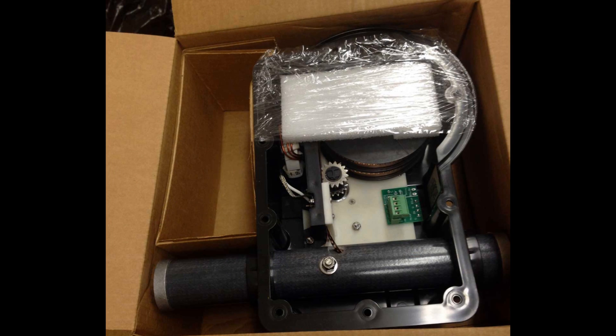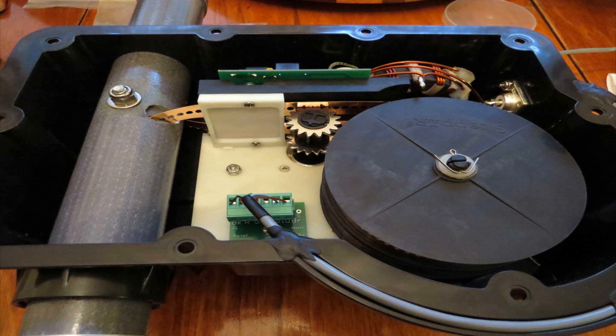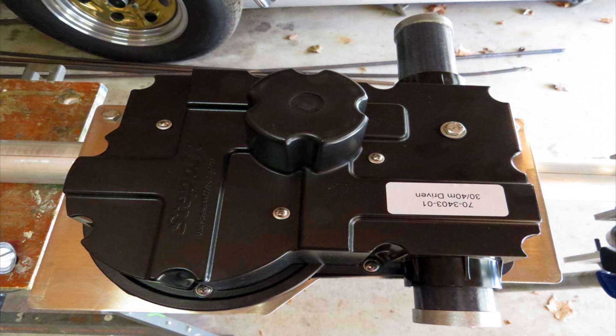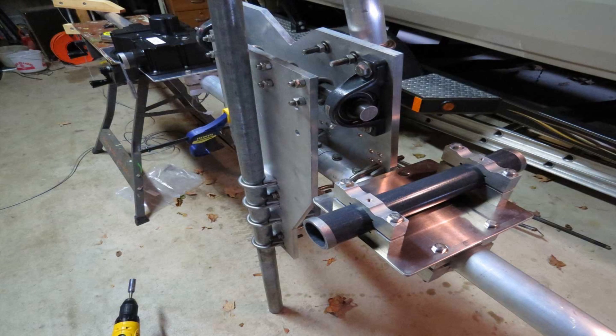The next task is to prepare the element housing units, or EHUs, and the mounting hardware for the elements. Control cables for the EHUs are prepared, and the ends of the cables are installed in the connectors. The control cables are routed through channels that are molded in the housing for the EHU. The hardware is mounted to the boom in precise locations as described in the manual. A hand level was used each time hardware was added to the boom to ensure that the elements would be level.